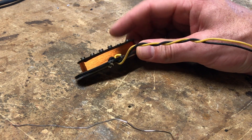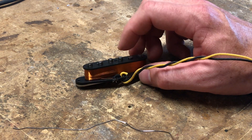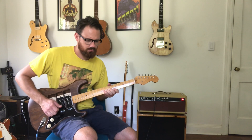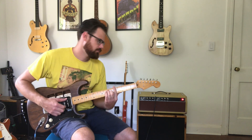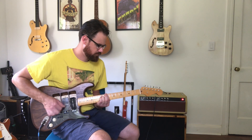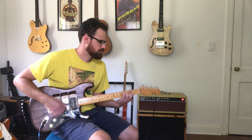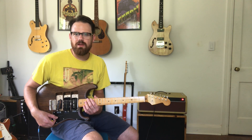That's it! From there you can wax pot this pickup — that'll help hold the base plate on the bottom a little better — or you can leave it unpotted. If you're interested in wax potting, go ahead and consult my wax potting video here on YouTube. That's the Stratocaster pickup build. If you like this video, be sure to subscribe to my channel, like and comment if you want to see any different types of videos in the future. Thanks for watching Scaladine Pickups — come again!